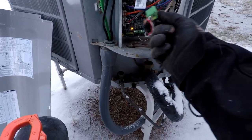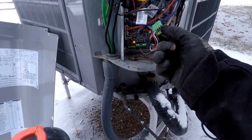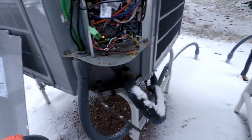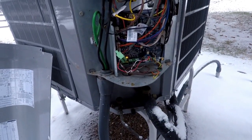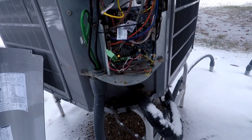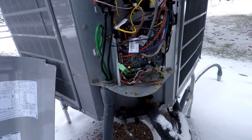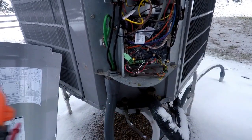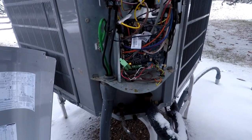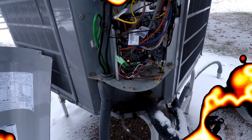This is known as an ABCD plug, and you have to have good continuity on all these wires for it to work. And I think we've already pulled some of these wires, they've gotten damaged in the crawl space, and then we pulled them off. So I wouldn't be surprised if more are damaged. So I'm gonna pull these wires off here and then go inside and make sure I do not have continuity between any of them, and then I'm gonna have to run back and forth and tie 2 colors together, then go see if they're touching, then go tie another 2 together, through each one of them and check my continuity.